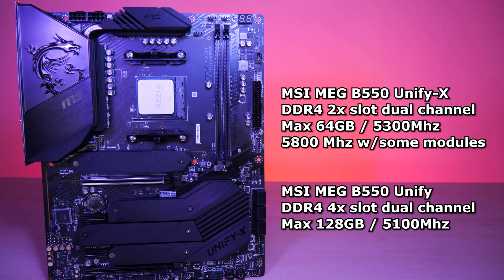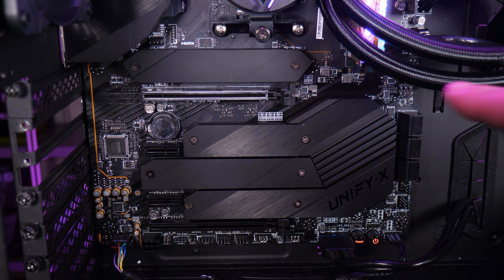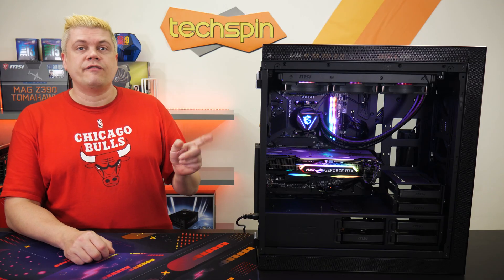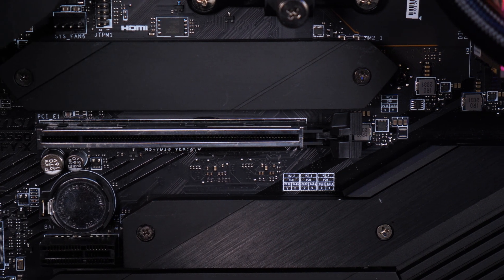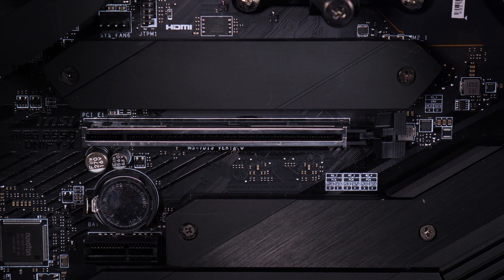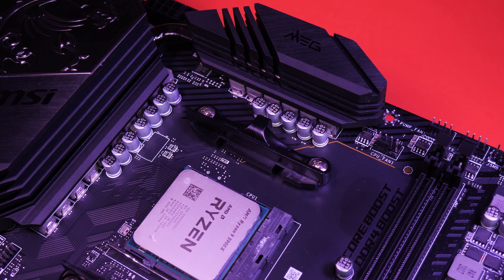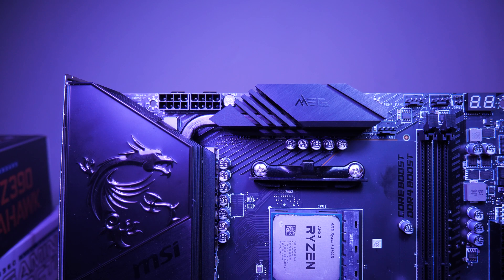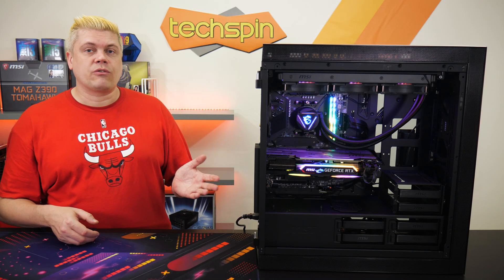This is the difference between the X version and the standard B550 Unifi — that board has 4 DDR4 slots and supports 5100MHz RAM. With Steel Armor reinforcing the top PCIe, this board has 4 NVMe M.2 slots all with Shield Frozr heatsinks. The top 3 are Gen 4 capable and the bottom is Gen 3. However, don't expect to drop a graphics card in the top PCIe x16 slot and still get full speed for every M.2, as some will switch over to the Gen 3 chipset. An integrated heatsink design and extended heat pipe combo covers all the VRMs, built into the rear IO shield cover. This board needs dual CPU 8-pin for overclocking, so make sure your power supply has dual ATX 8-pin. With the B550, the chipset runs a bit cooler than the X570, so there's no fan required on these boards.